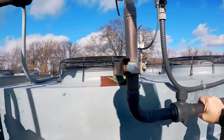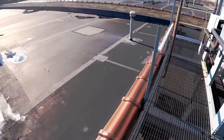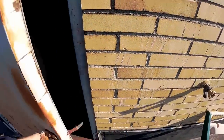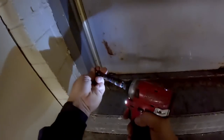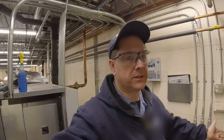Let's go to the condenser — it's running 182, so we're not running stupid high. Let's go outside and see the receiver level. We're still in split — nothing changed there. Now look at the receiver level — we are running 40%, 35 to 40%. That big old monster line, even though it's hot gas, is likely condensing in that coil. It's an air coil running room-temperature air, which is turning it into a condenser, so you're going to get liquid and it takes up space.